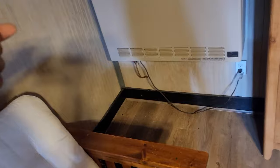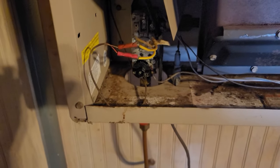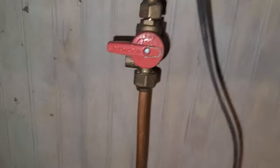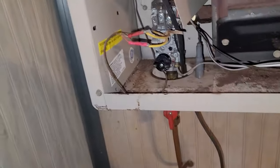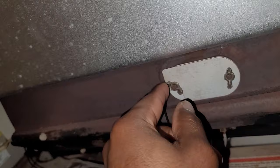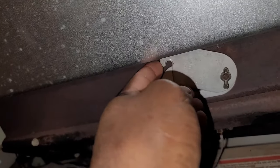The Empire unit — bottom, turn some light on. Bottom on, left. See, it's in the off position — that's off. Turn that on. There might be some air in the line, so I'm going to give it a little bit. Loosen the little window — loosen the right wing nut, loosen the left wing nut, and swing the little door. Don't take the nuts off, just swing the door. Like that. That way you can see your pilot.